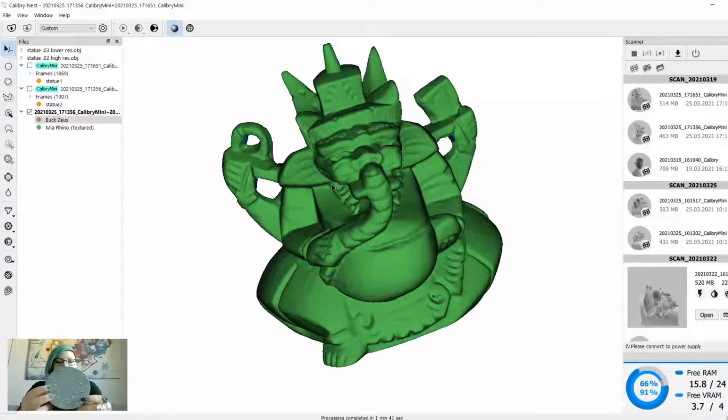Coming back to this object, for example, if I scanned this side in markers, and then I can scan another section in markers, it will combine them, but again, there would have to be some common points that they share. So if I just have this side and this side, there are no common markers in between them for the algorithm to understand how to connect them. So you would still need some overlap between them for it to be able to see the same markers here and the same markers here, then it will combine them together and not create some abstract painting instead.